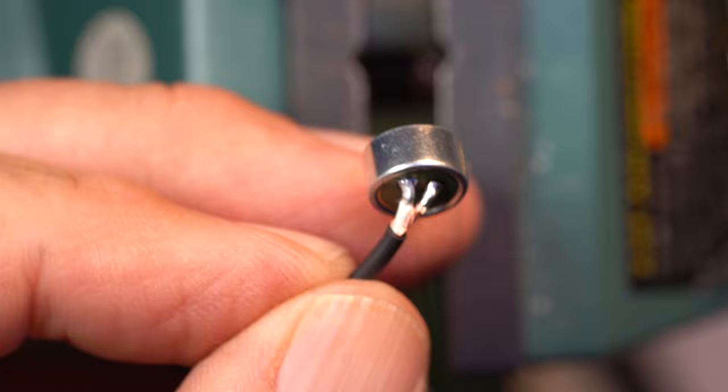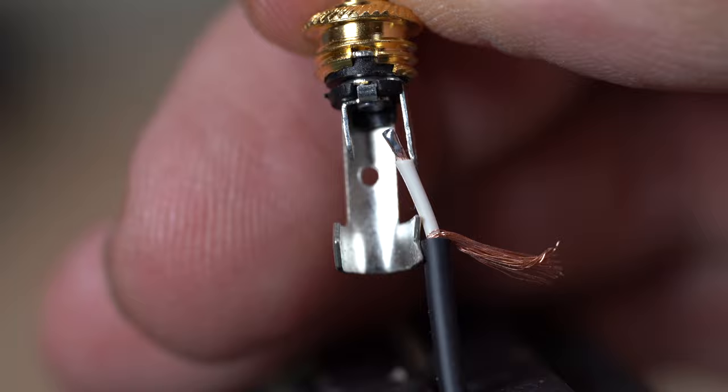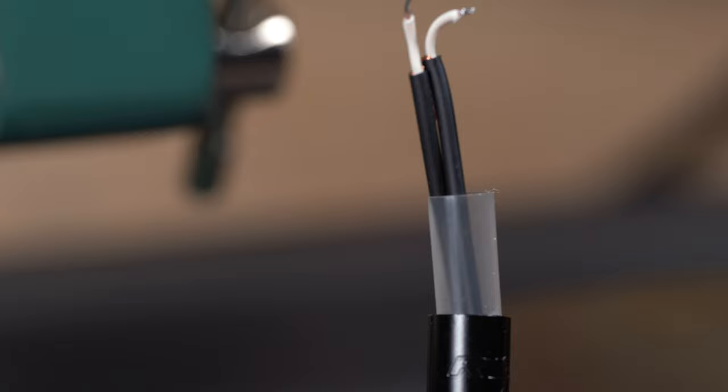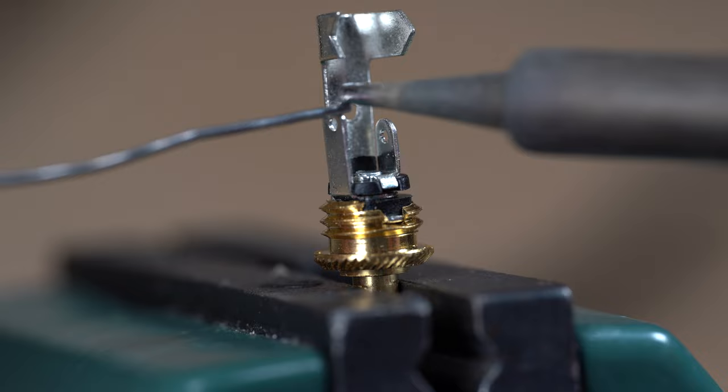This is going to get soldered to a 3.5mm jack, so pay attention to the lengths of everything here. Most importantly, put the sleeve and the connector body over the wires before soldering the connector. I kind of have to relearn this one often. Tin the connector tip and sleeve connections. This makes soldering so much easier.